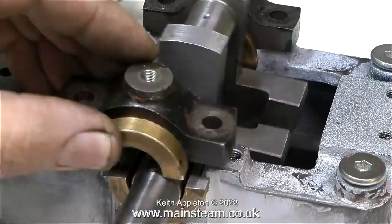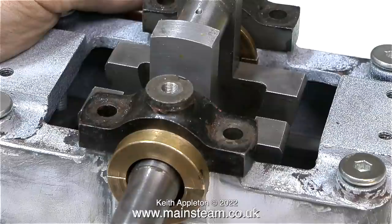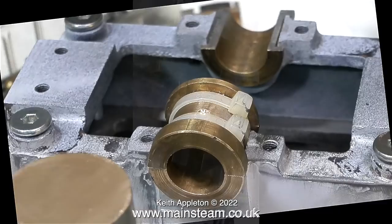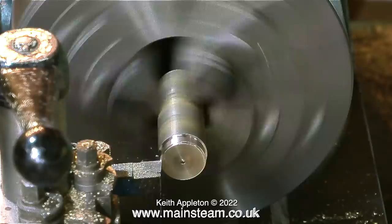The original plan with this engine was to sleeve the bearings, and I've contemplated doing this many times. So in this instance I'm going to sleeve these bearings and make it so I have a removable centre part. When they wear I can just pull out the sleeve and make another one, because it's much quicker to make a simple sleeve than to make these split bearings.